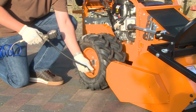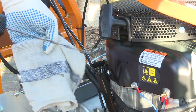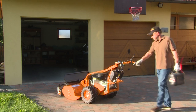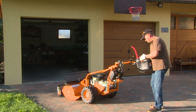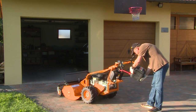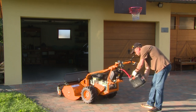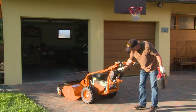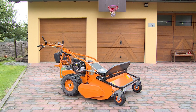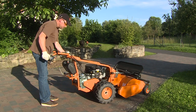Maximize safety and machine performance with a few basic checks. Prior to mowing, tire pressure and engine oil level should be checked. Fuel should be filled before the machine has been active, so that the engine is still cool. Gas is highly flammable and vapors can explode. The machine should therefore be outdoors and turned off while adding fuel. Never smoke nor operate a machine in an enclosed area, as dangerous carbon monoxide fumes can collect. Be sure to be comfortable with the controls and features before mowing. All controls should be easily reached; therefore, position your handlebar to the appropriate height.